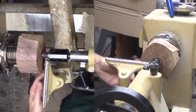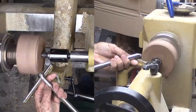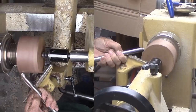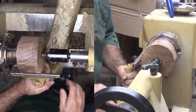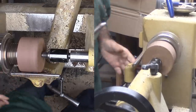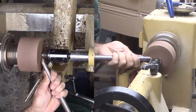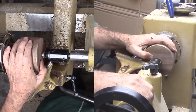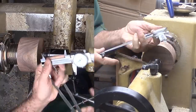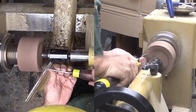For this project, I'm first mounting a small block of walnut to the face of my chuck jaws, held in place with the live center. I had sawn this wood fairly close to a circle to reduce the amount of rounding. I'm using a bowl gouge to finish the rounding process. Then I mark for a mortise since I want to hold this wood later with an expansion hold. I have to make sure I touch only the left point to the wood — bad things happen if the right point touches.